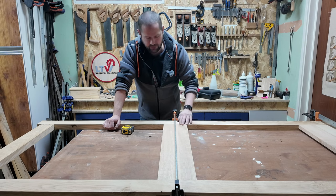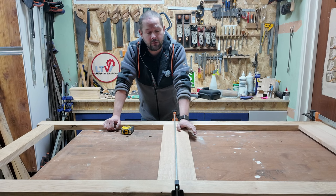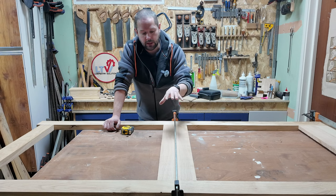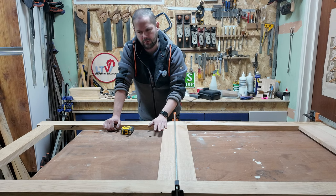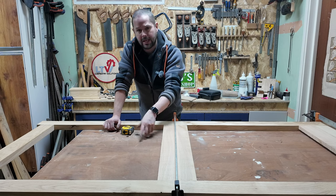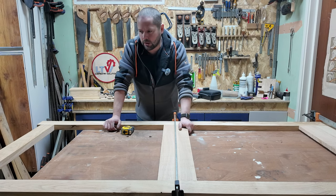I'm really happy with how well these joints have come up on here. But I'm going to leave it there on this one because I think this video is already getting quite long enough anyway. But what we're going to be doing in the next video is we're going to be looking at getting the diagonal braces in. I might domino them in, I'm not sure yet. You can just add them in afterwards because they are going to screw down into the slats anyway. But I might put some dominoes in there and just glue them up at the same time. I think that's probably what I'm going to go with.